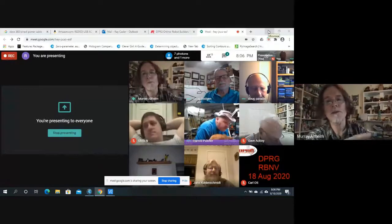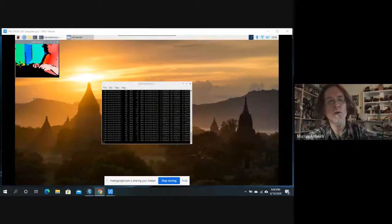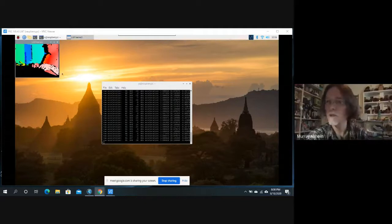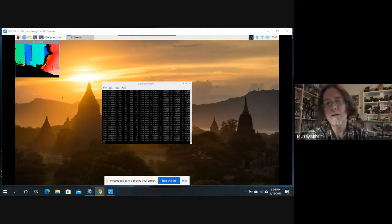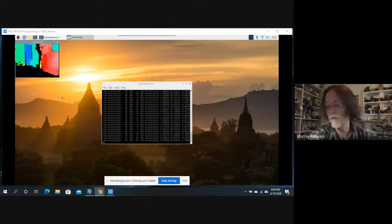And they do come with 3 kinds of encoders. There's an optical encoder and actually 3 kinds of Hall effect ones with different connectors. And they're quite powerful actually for their size, as long as your robot's not too big, or you're willing to gear down and take a higher gear ratio. But I've been really happy with them. I don't use them on my bigger robot, but on my smaller robots, I've been using them quite happily. And they come in like 60 different kinds of them.